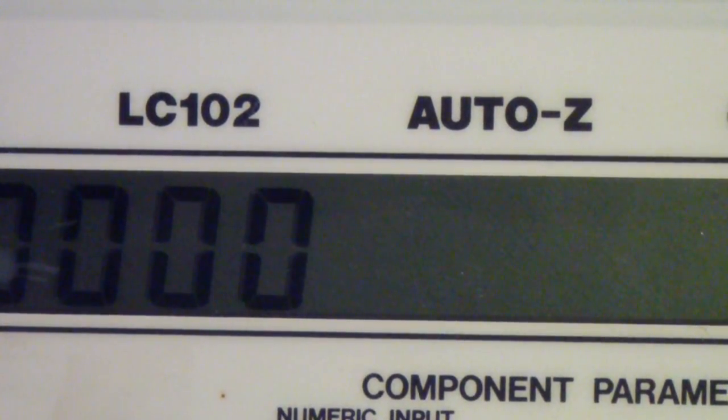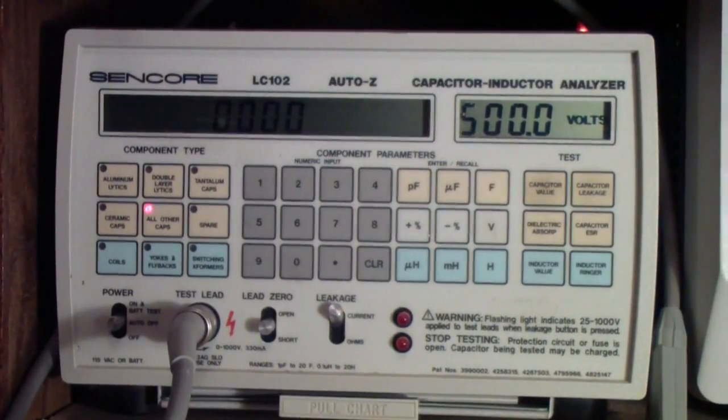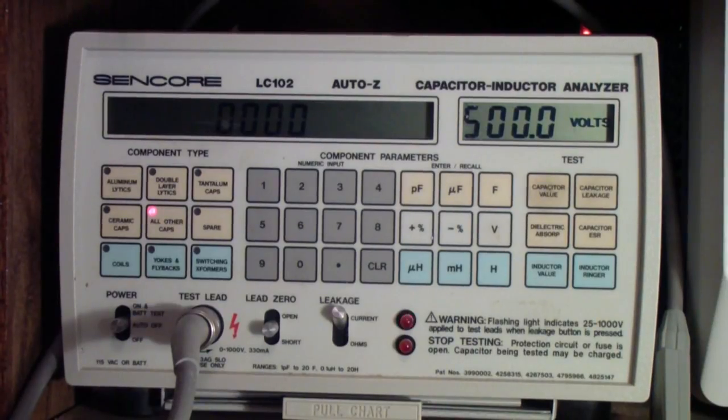This capacitor tester will actually go up to about 1,000 volts. This particular tester is a little bit old — I think it was made in the 80s. There was a successor, the LC-103, made beginning in the 90s into the early 2000s, but I think they've all been discontinued now. The nice thing about this is it really is a reasonably good tester — not a lab instrument, but primarily intended for people who service equipment with a wide variety of capacitor types. It can also be outfitted for automated testing and is often used in production environments to pre-screen capacitors before they're put on boards.